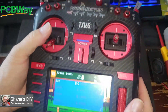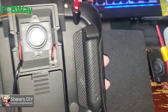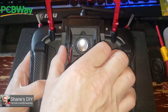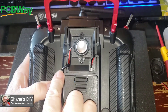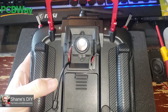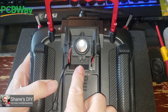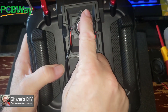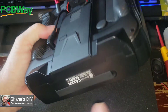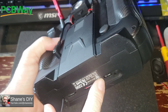The sound is significantly louder than the stock little speakers. There's my little modification. Hopefully it gives you some ideas. I kind of like this just because I can pop this off — I don't have to worry about modifying the radio. My next iteration, I think I am going to pop it open because I personally don't have a problem modifying the radio, though I was trying this approach because a lot of people might be interested in doing it without changing the radio. If instead of that little boost DC-to-DC converter I just take 5 volts directly from the aux ports — I did test that and it will power the amplifier just fine — you could eliminate that other power supply board.